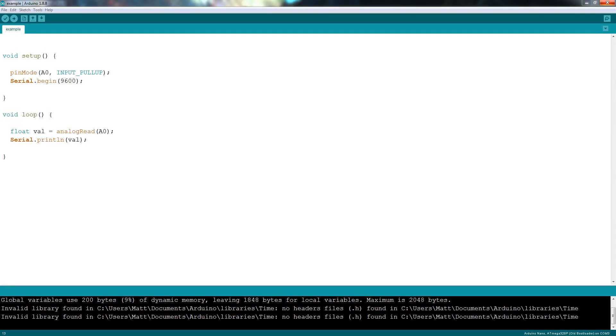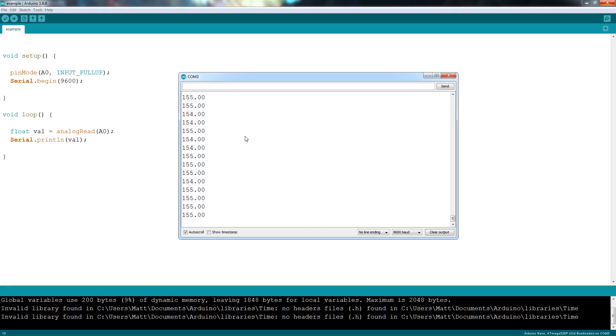On the coding side of things, I want to explain step by step what's going on, and I think probably the best way to do that is to start from scratch. Up here you can see we've configured analog pin zero as an input and also pulled that pin up, so it's positive — it powers the sensor. We begin serial communication, then set up a floating variable set to the analog read of that analog pin. The microcontroller is reading that pin for information. The raw information coming from the sensor right now is basically 155. This is not the number we want — we obviously want a temperature reading and not some random 155 analog-to-digital converter value. We have to take some steps to convert this into a temperature reading.